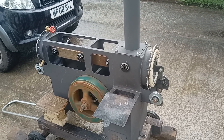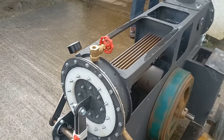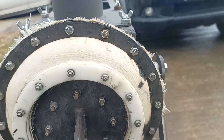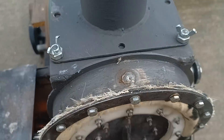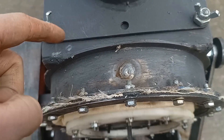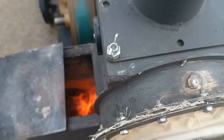We're going to call it a day now. The engine has been running for about three hours. The cold side is about how it was before and we don't have the heat issues on that side. The hot side is a little worse for wear — you can see the rubber seal was basically melted, but then it's only natural rubber anyway. We believe there is a lot of heat being transmitted through this piece here. Now that I've welded the cone on the inside, I can drill some holes to cut down on the cross-section so the heat isn't transmitted along it.